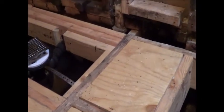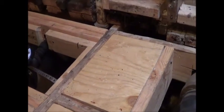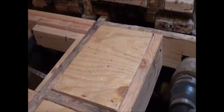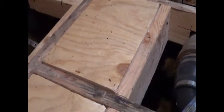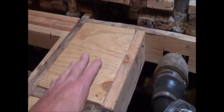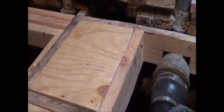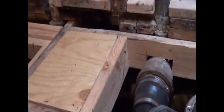And we measured, and that'll still give us about a 37-38 inch shower in there, which is a 7 or 8 inch gain over what we were going to have. So that's fantastic. Plus our floor sole plate will be laying perfectly on a lot of really good support when we go to put up this wall. So that will be excellent, and then we'll worry about making the connections up top.